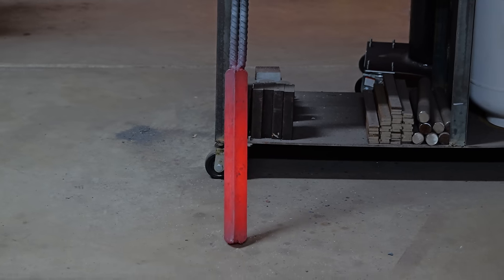The billet was pretty solid for the most part, but there was one problem area where one of the corners of the tiles didn't really want to weld. I took it to the grinder and ground through that little delamination. This is going to be an eight to eight-and-a-half inch blade — actually, eight and a half is kind of long for a cleaver, so I think I'll do eight inches. It might look like cheating when I cut off material I don't need, but this material is so time-consuming to make and so valuable that I didn't want to risk forging down a tang for it. I realized I could use the table on the side of my bandsaw — turning it into essentially a port-a-band.